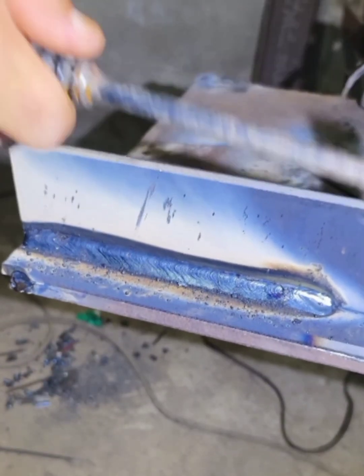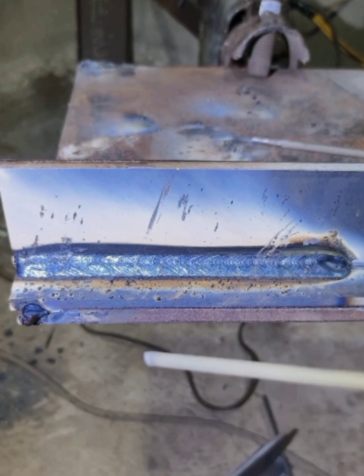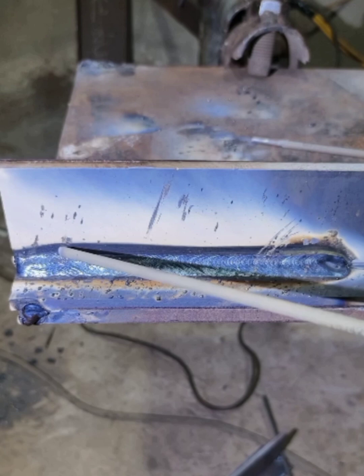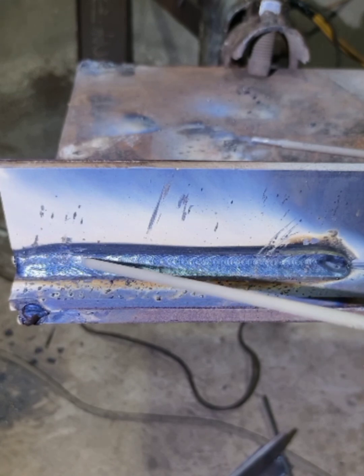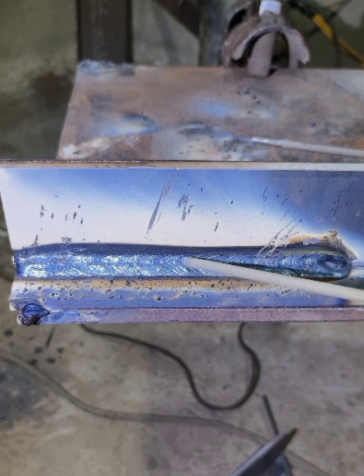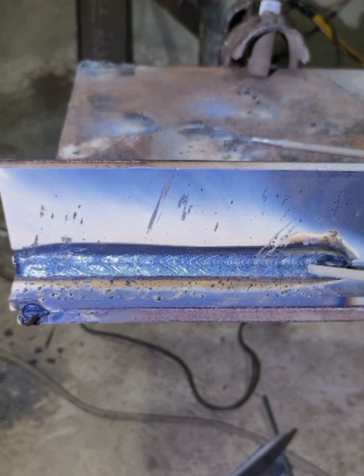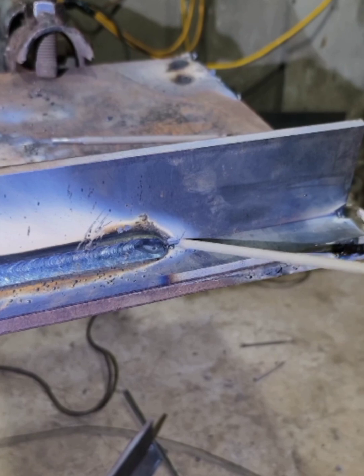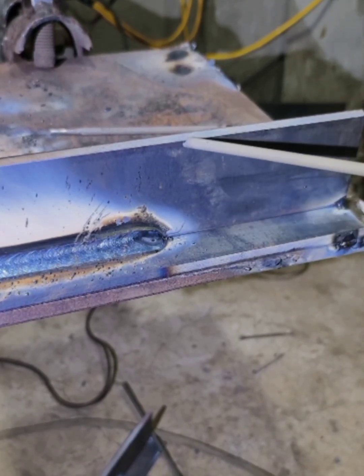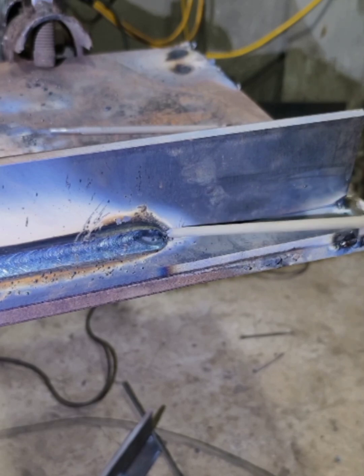After removing the flux coating to see the internal molding — the coating is easy to clean up and the weld is beautiful. Just get the method right and then practice hard. There's no need to practice blindly every day only to get tired and discouraged. The correct operation method: arc from the upper side and bring down, directly choose pull welding, go straight, and weld the electrode without any swing. When the current is too large and the temperature is high, increase the electrode angle in the welding direction. When the current is small and the temperature is low, reduce the welding direction angle, pulling the electrode at about 50 degrees in a straight line. When there is less molten iron on the upper side, press the electrode down; when less on the lower side, lift the electrode up, but the maximum cannot exceed 45 degrees. Welding is easy to get started with but very difficult to master — practice the right way and there will be great progress soon.